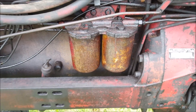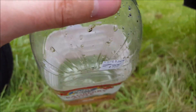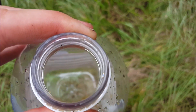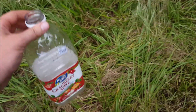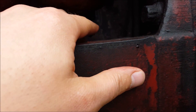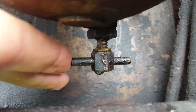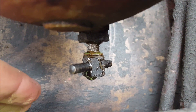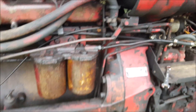It's a long screw that goes to the bottom and holds it on. I already see a problem — this is all that came out. It doesn't look very healthy, it just looks watery and weird. I don't know why that's all that's coming out. The screw right here has a flat side to it — see that flat part with no threads. Once you get there, the hole is open that much and liquid should be coming out. Let's go ahead and take the housing off and see how it looks.